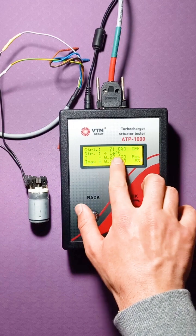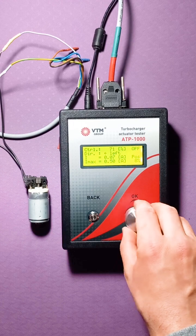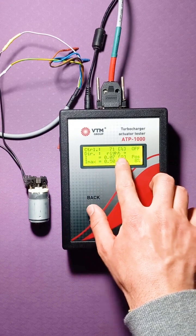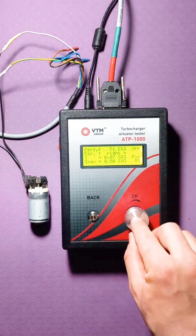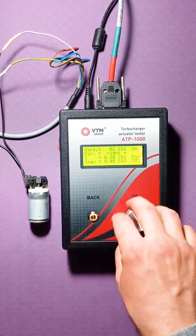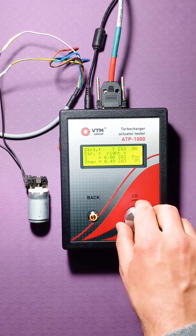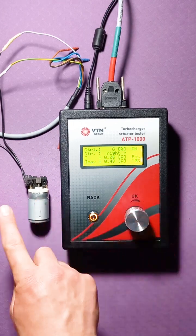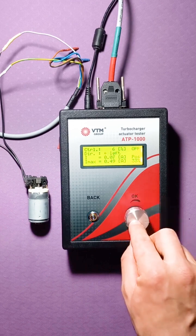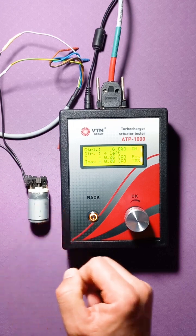Only in this mode, that is, during the stopped mode, can you change the direction of rotation. So we rotate the arrow of the regulator to the right. That is, in this case, the movement will be in the right direction. We launch it again, we see that it has started to rotate in the other direction. We're going to turn it down again. That is, we see that now it is rotating conditionally counterclockwise. We change the direction, we see that the direction of rotation of the engine has also changed. It began to rotate to the right side.